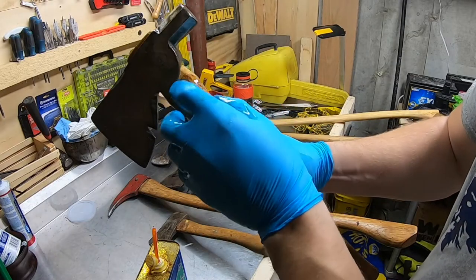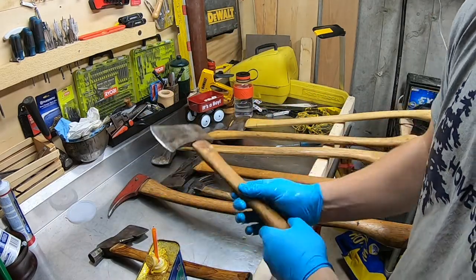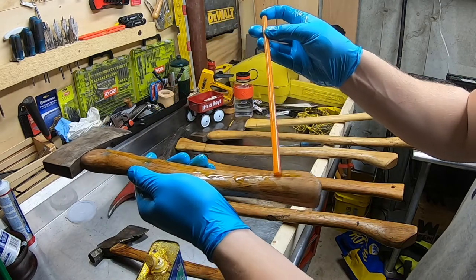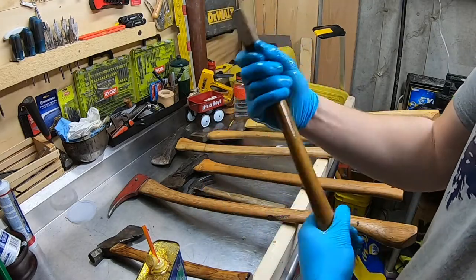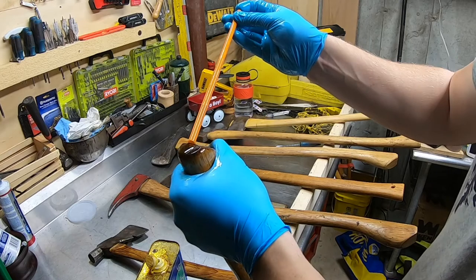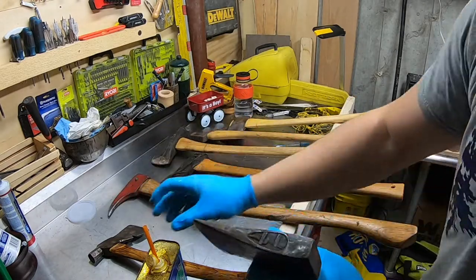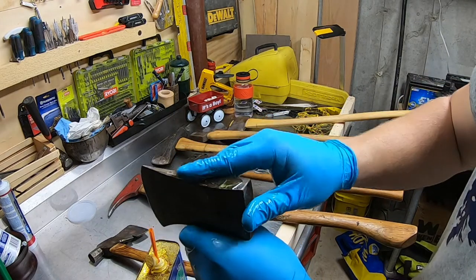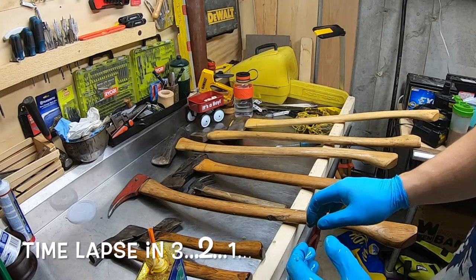Really apply oil at the end grain, around the cheeks, and at the top wedge area — then we're just going to continue right down the list. Take your straw and lay a nice bead of oil. Boiled linseed oil is expensive, so I don't want to be wasting it. I've seen guys dump it in their hands and it makes a mess with buildup as you go. Be generous with the butts — the end grain — and generous around the eye too.